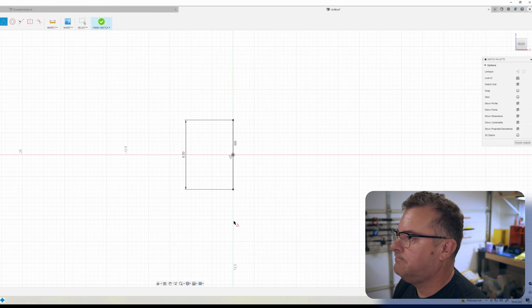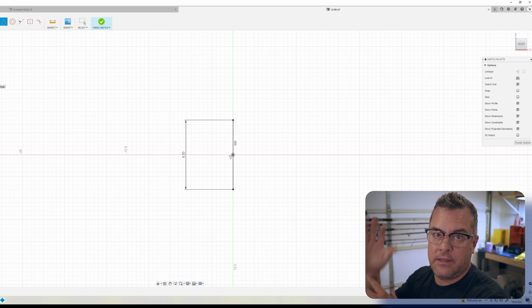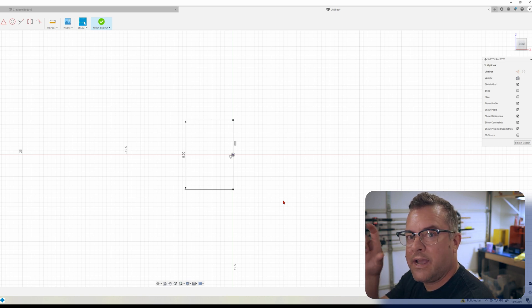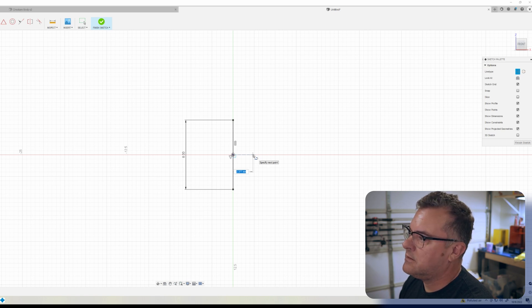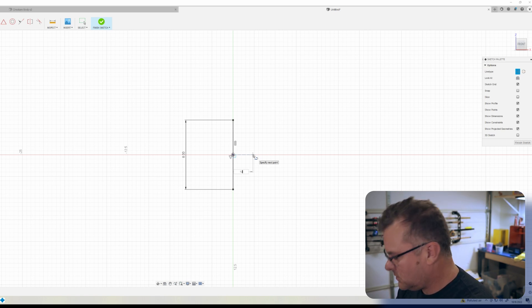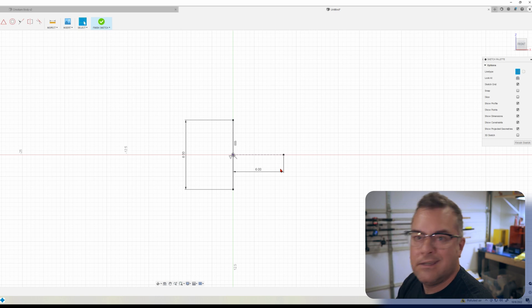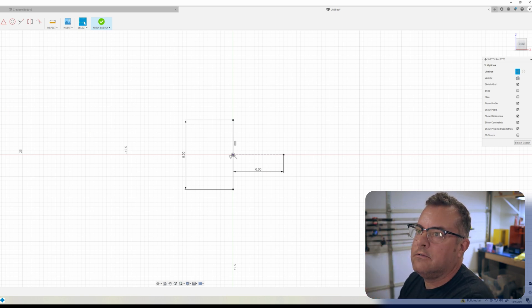We want to make that cross-style section, and we're only doing the right half — we'll mirror it all at the end. We got that line in the right spot. Let's figure out how wide we want this to be — we're going to use a construction line coming right out of the center. We're eight millimeters tall, so let's go 12 wide at the front. Since we're going to mirror it, we actually want to make this six, so it'll be double the width.